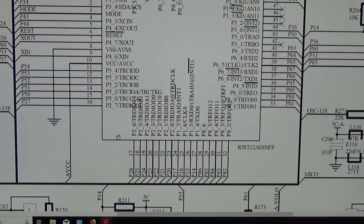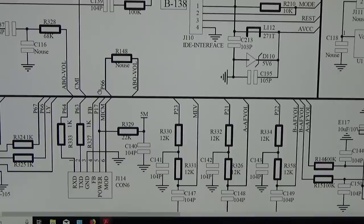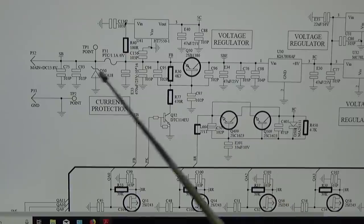So that makes sense, because we have seen that must be something different. I'm not entirely sure. Anyway, important for the moment is our FB. That means FB should be present at our connector. And going back here, where is it? We see that this FB should be our 13.8 volt. So that is what we should test first, if we can read our FB.